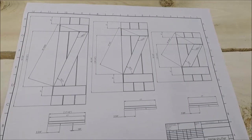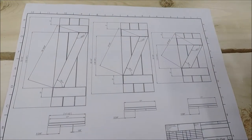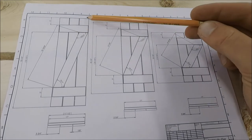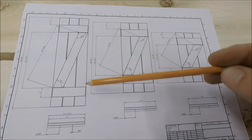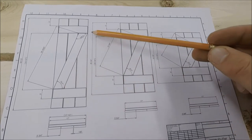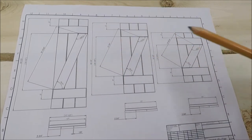Made a quick dimensional drawing here, just showing you what the shutters are going to look like. Three boards, 5 and 3 quarters in width, roughly 1 inch thick. The standard depth here is 5 inches and 5 inches. These boards will be 5 inches cut on a diagonal. The only reason I need this drawing is just to get these angles here to help mass produce these.